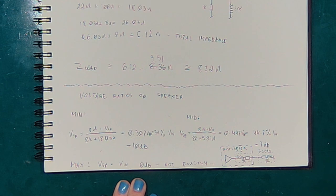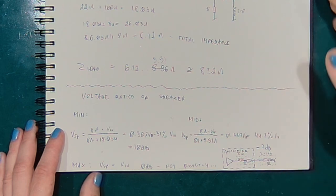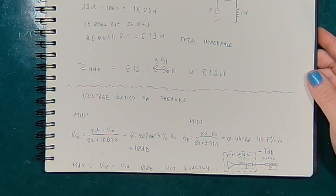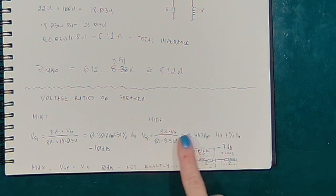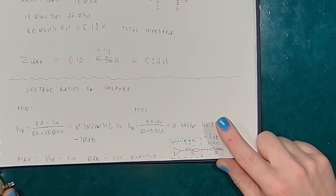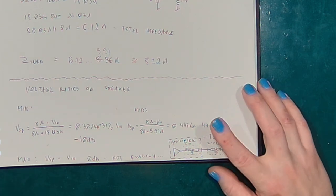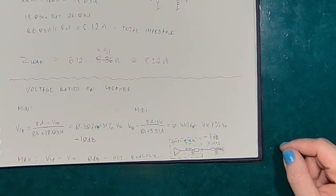because by convention the dB value is 20 times logarithm base 10 of the voltage ratio. And in the middle position, we've got 0.44. That's 44.7%, and that would amount to 7 dB attenuation. And of course, in the max position, it would be 0 dB, though it's not exactly 0 dB, because the whole branch